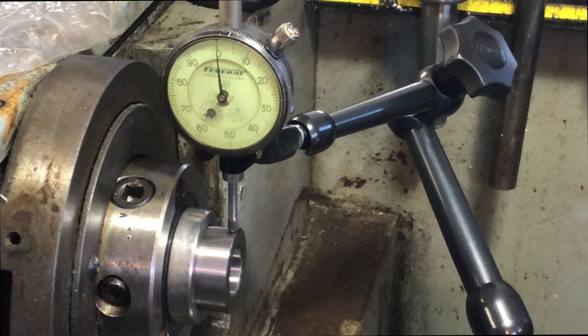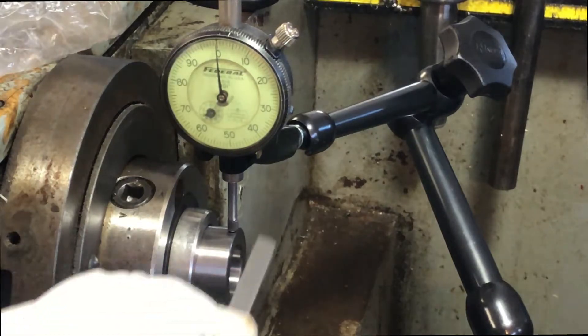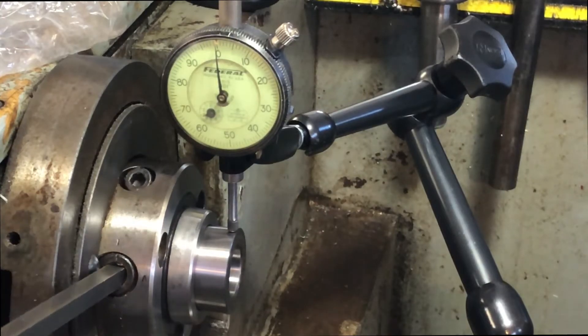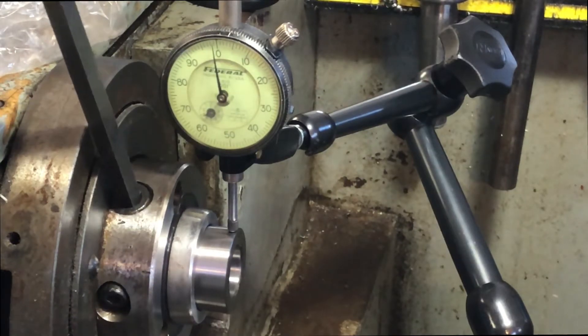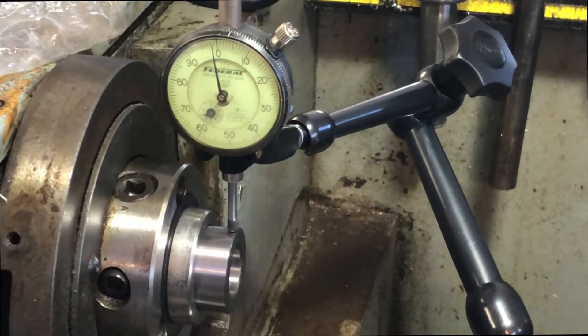Just playing around here, because it's my shop. Taking a quick look — not an optimal setup, obviously going onto a taper with a roughed-up old Federal dial gauge. By the way, if you don't have one of these dial indicators, they're built like a brick outhouse on the inside — very good. Pop the back cap off and take a look, they over-built these things. If you see one in a lot on eBay, get one. I'm using this bar to reduce as much influence as I can — there's about a thousandth or so. Not optimal, but staying about a thousandth.